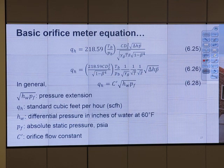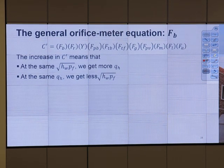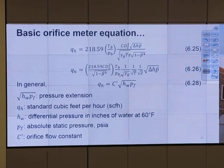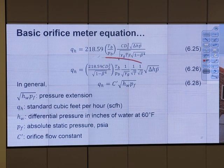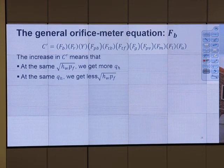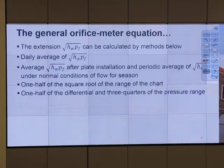Okay, the reason that we do this is because there is some kind of error or unknown constant that we cannot really calculate. We have to get it from a table. We will give you more accurate values. Everything actually can be calculated if you want to calculate it. You see, diameter squared, beta, area ratio, gamma sub t, bar z, compressibility factor. These terms can be calculated, right? Each of them. But the recommendation is not to do it that way. The recommendation is to get each term from the table on the back.